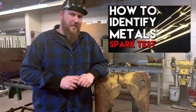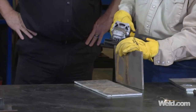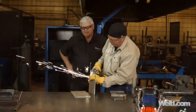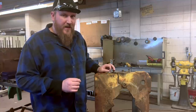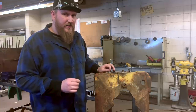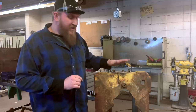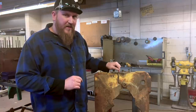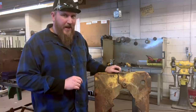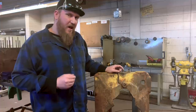There's a really good video posted by weld.com where Mr. Moffett and Mr. TIG had a conversation about identifying base metals using shop tools — specifically a spark test. What's that going to help you do? It's going to help you gauge carbon content. I know this is cast steel, but you might be walking up to something you have no idea about. Identifying carbon in steel is important because it gauges how hard that steel is. More carbon means harder steel, and the more finesse you'll need in your repair. Spend a couple minutes and go watch that video.